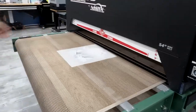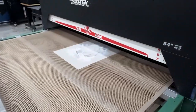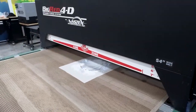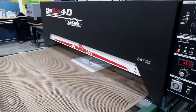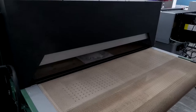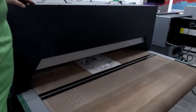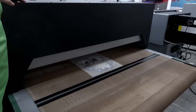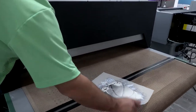For this demonstration, we are drying the transfer using a Vastex Big Red 4D Conveyor Dryer. Dryer settings may vary. During the drying process, the adhesive powder should turn transparent with an orange peel glossy texture. The goal is to cure the ink and the adhesive powder at the same time to create a single bonded dry image before transferring.